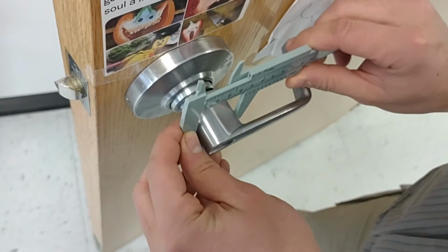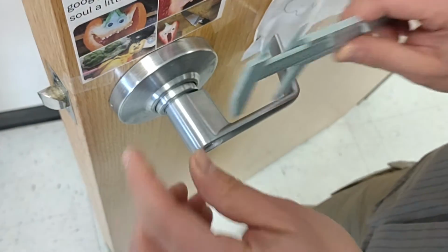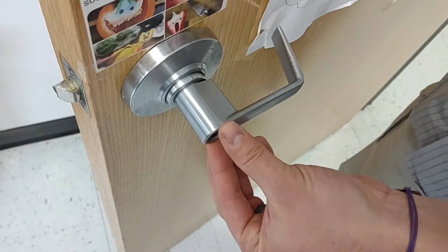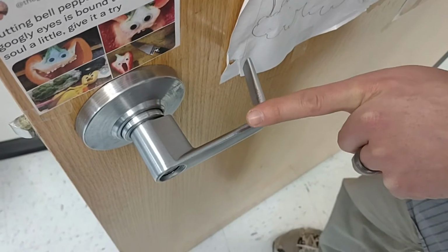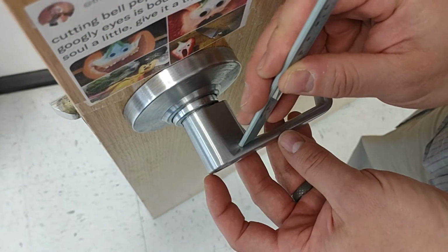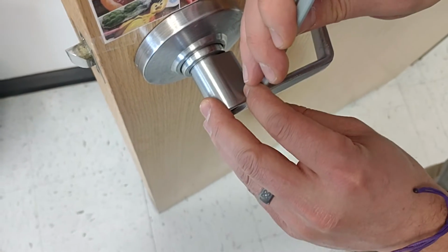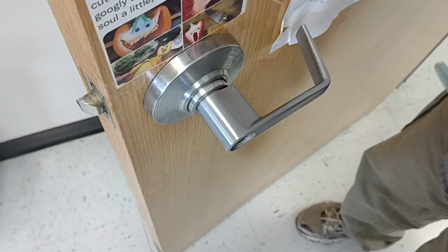And then right here we have 36 millimeters. The starting looks like it goes on either side right here. Can you see that taper right there? Yeah, kind of. Okay, so the taper depth before you do an arc is going to be 2 millimeters. So it tapers down, and then we have another arc around here.